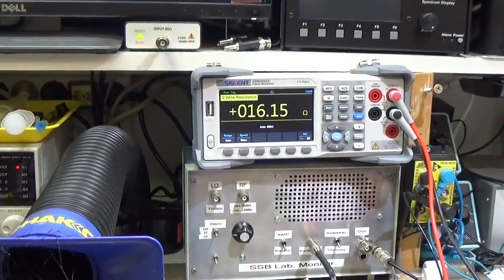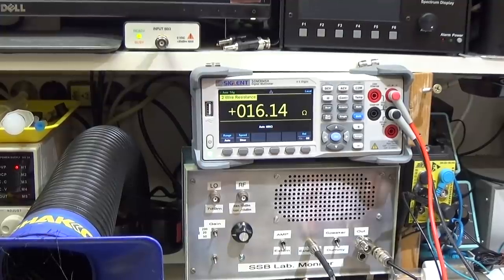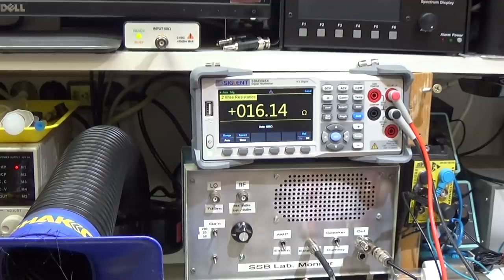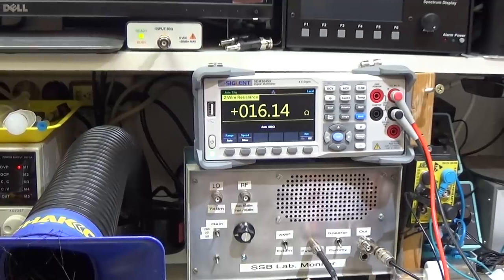I mean, it has improved because the shorted diode is out, but 16 ohm is still a short to ground, so that is not normal, considering that we only have now the ICs on the bus, so therefore that is no good sign. So it looks like the diode tried to protect the radio but shorted out, and when it was shorted out, all the high voltage was able to get through to the ICs, and maybe something has happened to the ICs.